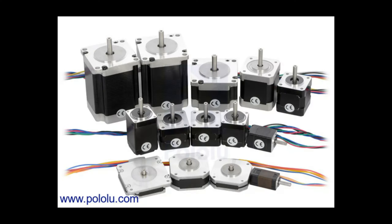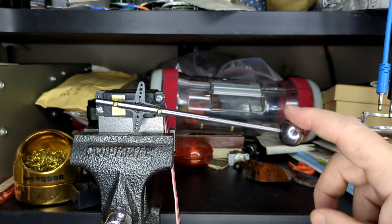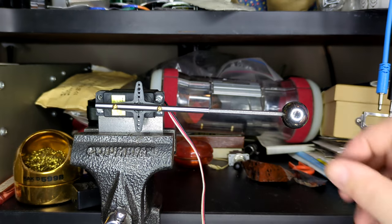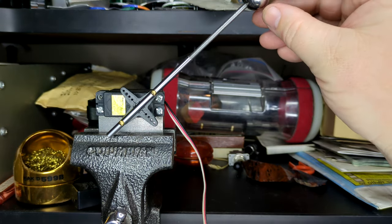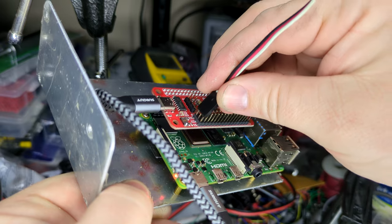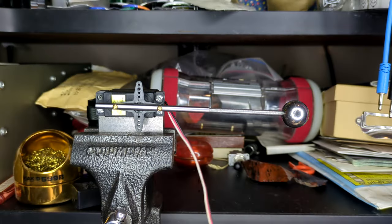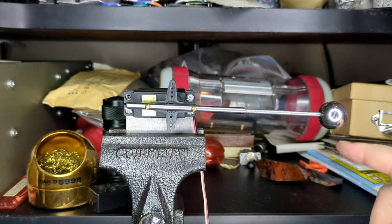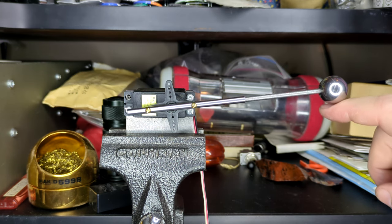The obvious choice for this was stepper motors. These are cheap, commodity motors that can be controlled to rotate by specific angular amounts. They are similar to a servo motor with some key differences. A servo has a sensor built into it that directly measures what angle it is at. Turn it off, unplug it, and manually twist the horn to a new position. As soon as it has power again, it'll know what angle it is actually at. A feedback loop will actively try to maintain that angle, so you can push against it and it'll push back. Even if you manage to overpower it briefly, it'll still go back to the set angle.